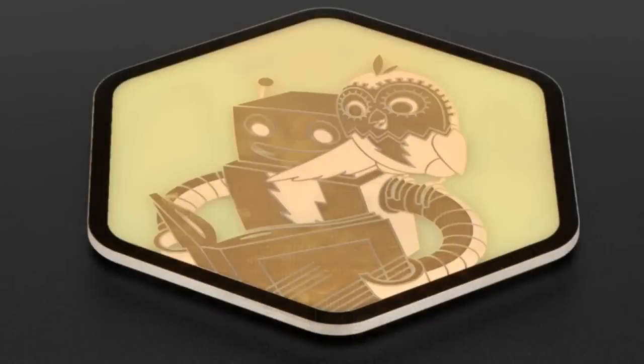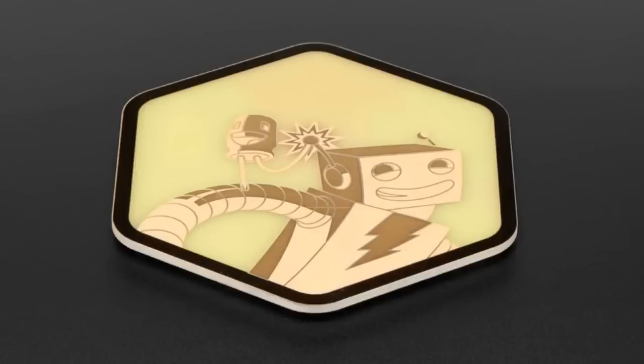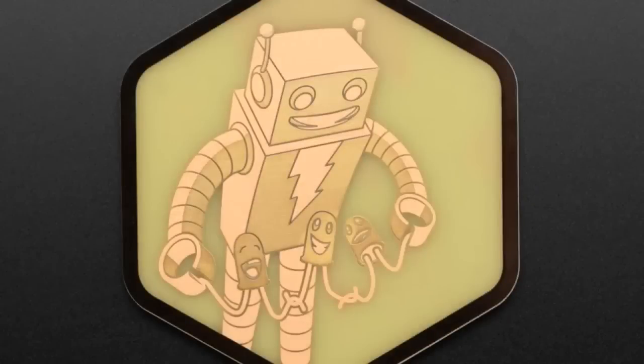They're made with non-marked FR-4s, so you have to find a factory that doesn't have any water marking on the FR-4s. It's little things that nobody cares about but we care about. It's a clear copper mask — so it's copper but then we get a clear mask, so it's protected but it looks like a bare PCB. And then we get gold ENIG plating for the highlighting, so it has this bi-tone look to it.